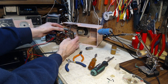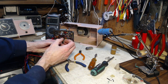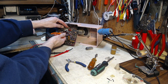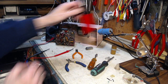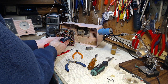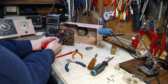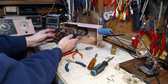Working in there is going to be just about impossible. I can pull back these wires and prepare them back here. I'll make up the pair of capacitors and place them in from the top. I'll pull back these wires here, on the assumption I can get on them better under here. Just nip a little bit off the insulation. I don't want to take too much off here — this one's really waxy or greasy or something.